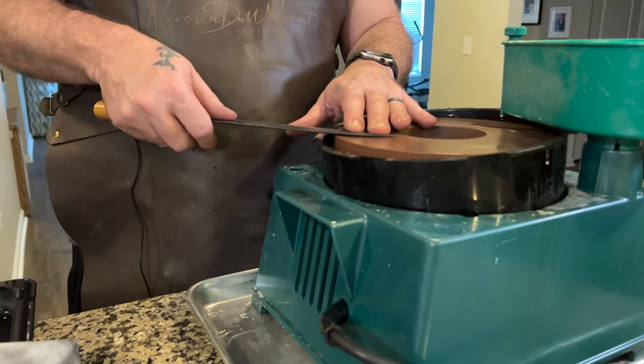If you can't see the removal happening, there's a trick a lot of you more experienced people know. If this is the first thinning video you've ever watched, you would take a Sharpie and mark the blade — it's the magical Sharpie trick. It comes off by rubbing or washing. Try your best not to go onto the cladding way up high above the shinogi line.